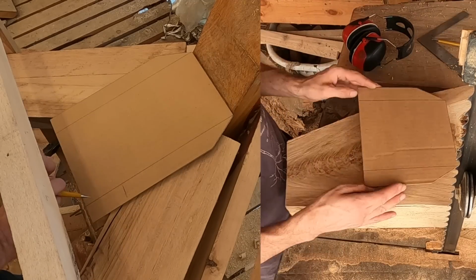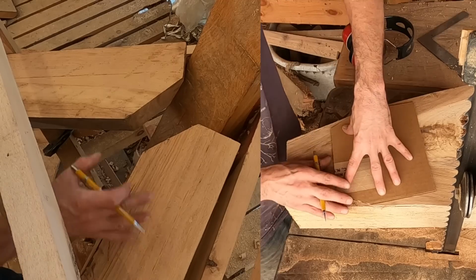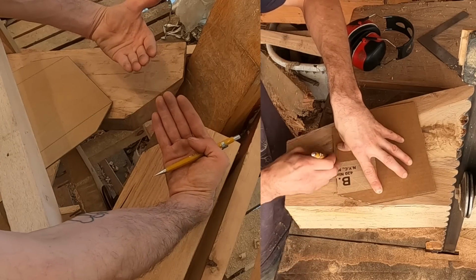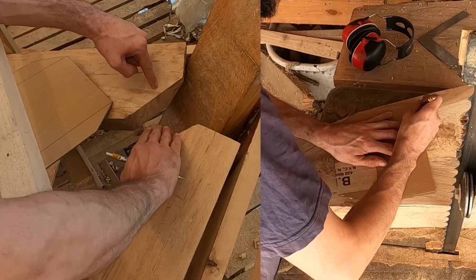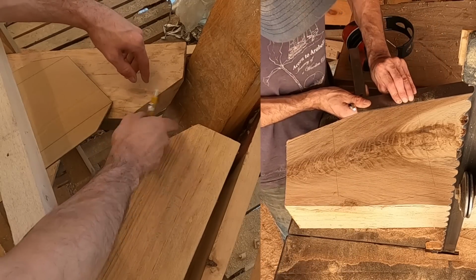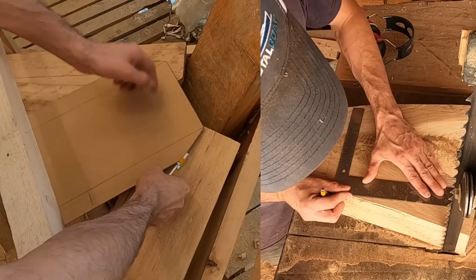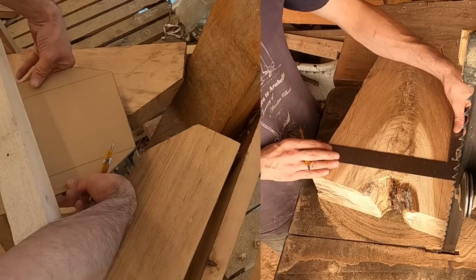And the next step is going to be to rough out that block and then get these trimmed. And I got to start picking up angles and being careful how I go about doing this, because they're coming in at an angle. So I got to cut the bottom of the angle at the rebate. And then these, if they're cut at 90, they're going to be funny angles at the top here. So I want to make sure that when I cut these, I cut them at the correct angle so that they're plumb and they're just dropping down. That way when I cut the rebate, I can cut the top 90 and I can do the edge at an angle and take it out, and it should fit right in there. But we will see.